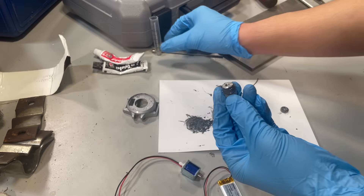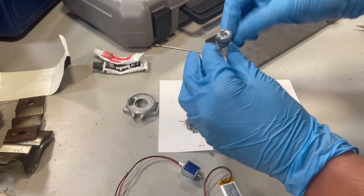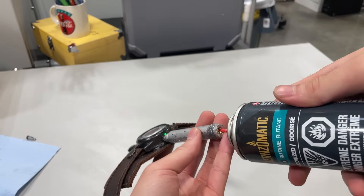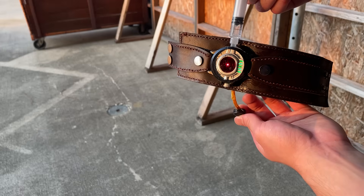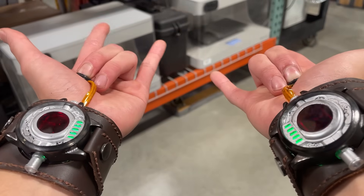Now for the negatives. It was a mistake to try and use JB Weld to bond a lot of this, because it turns out it doesn't adhere very well to polypropylene, which is what syringes are made of — I should have used an epoxy more well-suited for plastic-to-metal connections. Also, next time I build web shooters, I think I should put the solenoid valves on the cartridge itself, because with this one you have to fill up the cartridge, attach it to the web shooter, and then pressurize it. It's also very much worth noting that these valves have an unfortunate tendency to clog up after the excess webbing is cured and it prevents the internal spring from moving. You can prevent this by running solvents through the valve several times after use, but it's still kind of a pain. Anyways, if you enjoyed this video, be sure to like it and share it. I'm going to be doing a lot of Spidey content in the near future, so be sure to subscribe. I'll see you later!